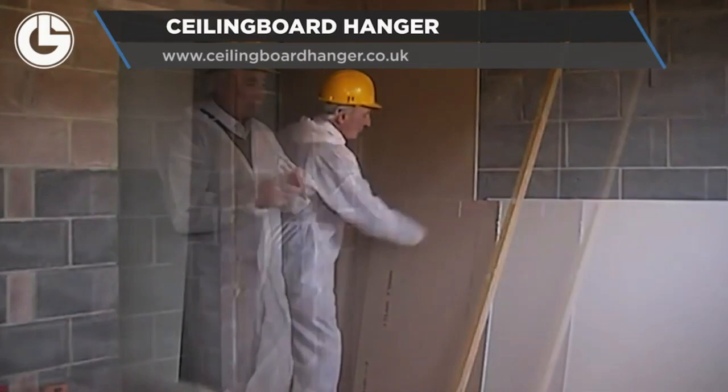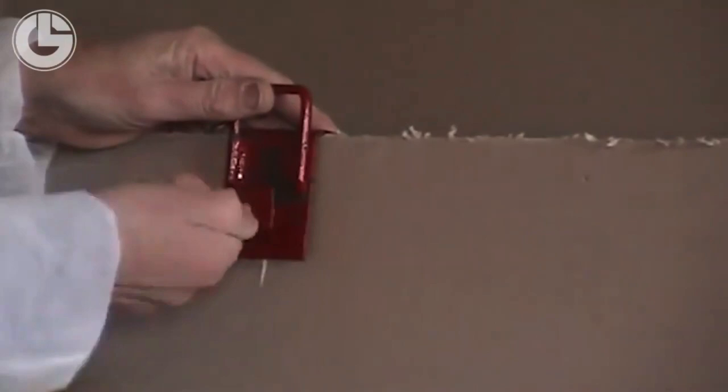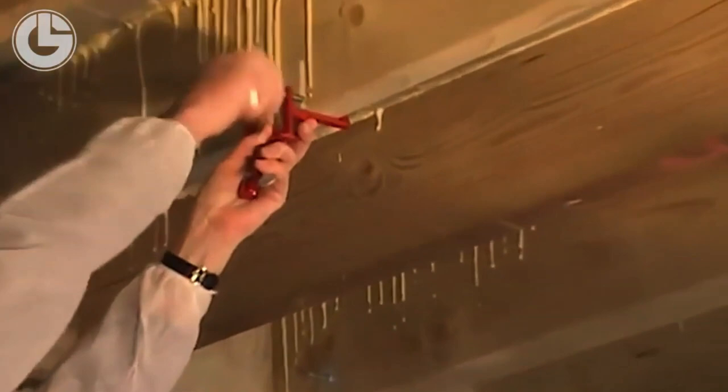Ceiling board hanger. Doing ceiling work takes a lot of energy due to precise drilling for attaching board clamps, but now the ceiling board hanger is available to cope with this difficulty. The worker just has to tighten the four clamps, two at the ceiling and two at the ceiling board. With it, a single person is enough to hold and align the panel in position.